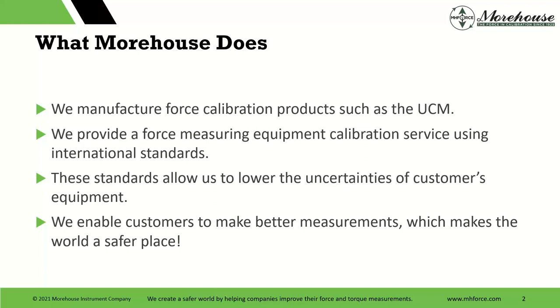With our automated UCM, you can set most anything. You can set, I want to control the force within 0.002%, I want to control the force within 0.005%, I want to hold the force for at least 20 seconds, I want to hold it for at least 30 seconds. The automated cal machine will help reduce numerous operator errors because machines can just sit there and hold that force as well as you program it to. Calibrations are quick, and there's data capture and all the bells and whistles with it as well.